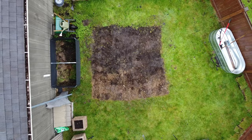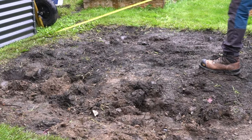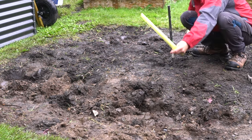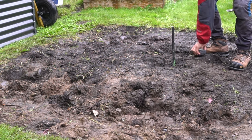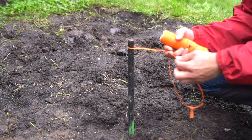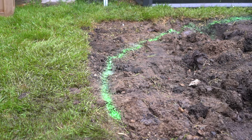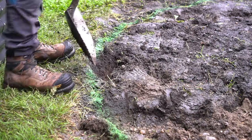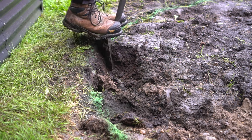For this project it all starts with the backyard and the placement of this flagstone fire pit area. Luckily someone removed all the grass, so I just need to get to the soil. This is going to be a round patio area and the easiest way to determine center is to take a tape measure and place a stake there. I then slide on a string line and with marking spray paint I'm easily able to maneuver around the stake to create a surprisingly good circle. Just remember that this circle doesn't have to be perfect — it just gives us a general idea where to excavate.